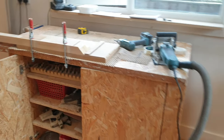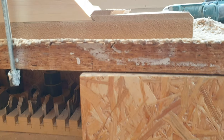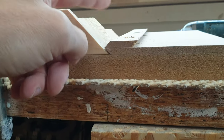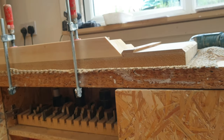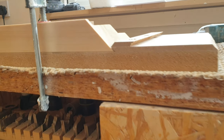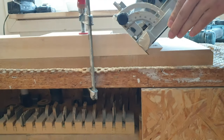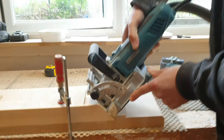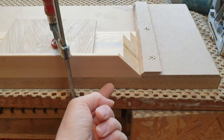So we've made up this little jig, which is a piece of 25mm as a flat surface. Let's look down the side - we put a piece of 6mm on it first. There's the first layer of 6mm with a mitre the other way. We then put another piece on top with the mitre going the opposite way. Our timber that we're actually putting a biscuit in slips into that joint. This one gives us a shoulder for the biscuiter to actually sit on. We had to lift it up slightly - otherwise when we biscuited it, the biscuit would be too low on the surface and come through the face of the frame.